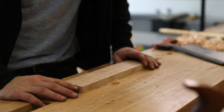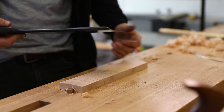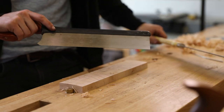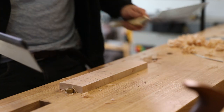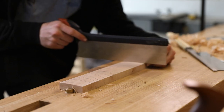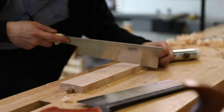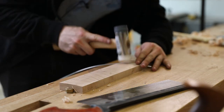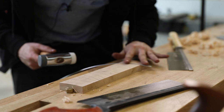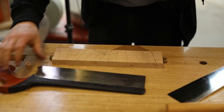I've just made a practice board to practice my frets. There's a very slight radius on it and I've drawn all sorts of lines over it. I'm going to test firstly my sawing and secondly which saw I actually want to use. I've got a Japanese saw in a rip cut pattern and a standard cross cut carcass saw. It's working quite well with just the Japanese saw so I think that's what we're going to go for. This saw has such a thin kerf anyway — if it does turn out to be too narrow on the ebony I can just widen it with this saw later on.